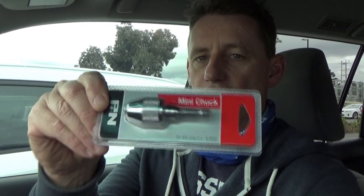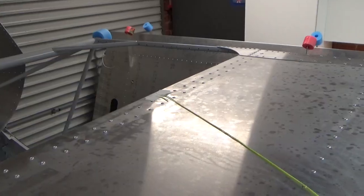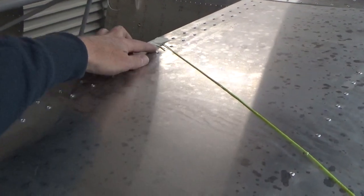I found a little 90-degree angle extension. I use a number 11 or number 12 drill bit for those 3/16th bolts — the 3/16th drill bit, believe it or not, is a little bit too small for the bolts to go through, so a number 11 is perfect. So I've got the right drill bit and a mini chuck. You can just imagine — if someone at a restaurant yelled out 'quick, has anyone got the ability to drill a 3/16th hole in a tight spot?' — this guy has.